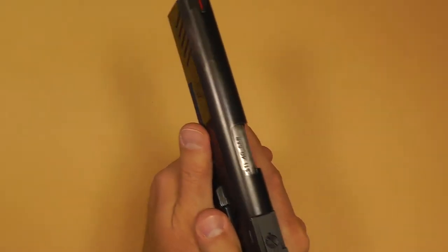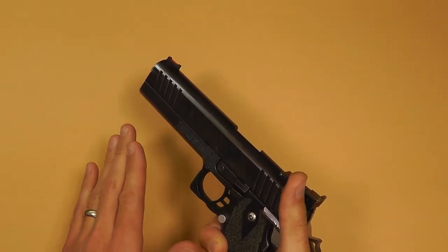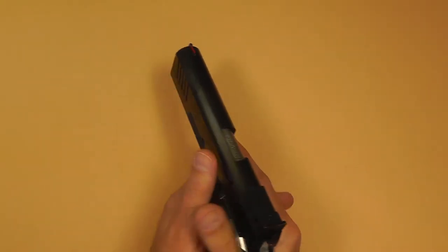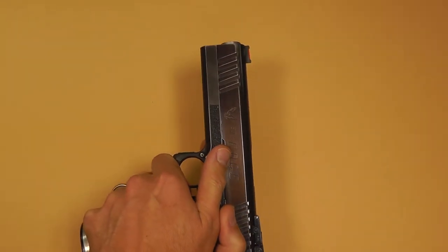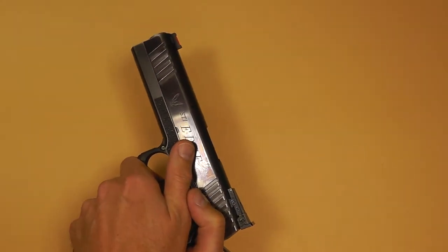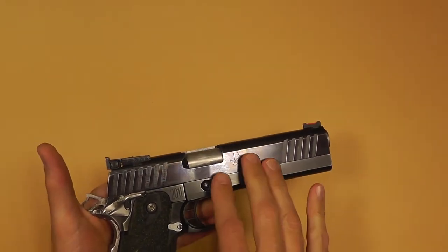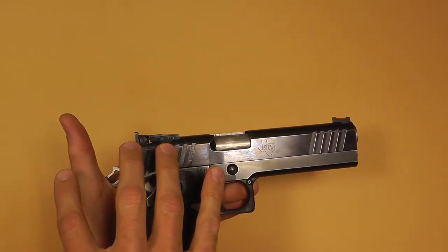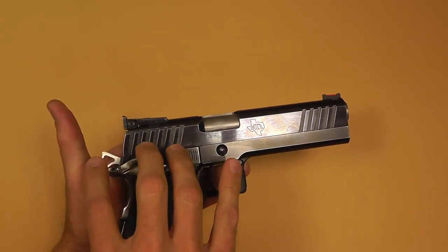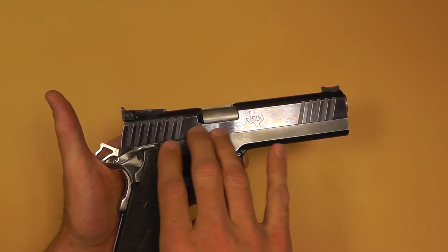On your first shot the gun rises and comes back down, but if your firearm is too light it's going to rise up a lot more and take longer to come down. People like to add weight but they're not thinking about the recoil spring as well. If you have too heavy a recoil spring, when the slide closes it's going to do a nose dive. Also, with too heavy a recoil spring the slide isn't going to stay back long enough to strip the next round off the magazine, so you could get failures to feed.